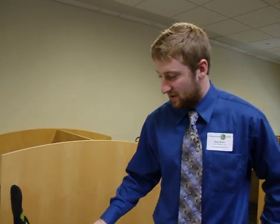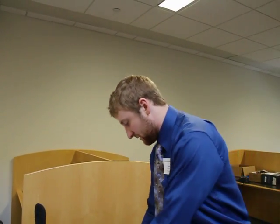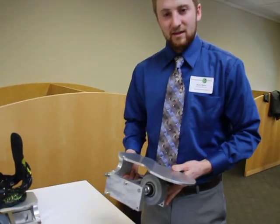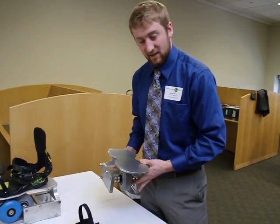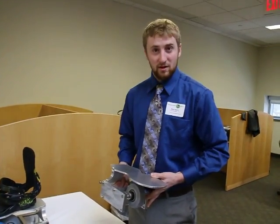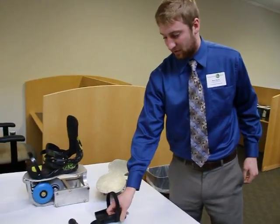I'm Bo Beyers, mechanical engineer at MTU for the portable assisted mobility device. We have a couple of things we wanted to implement in the future, because this is just a proof of concept to prove that something can be made to these dimensions and actually function. We want to make the body out of glass-filled polymer or something with a better strength-to-weight ratio than the aluminum we're currently using.